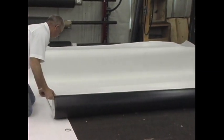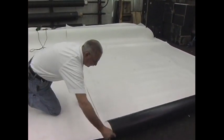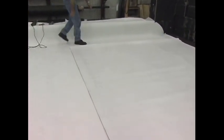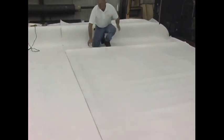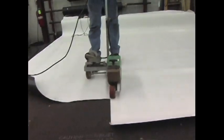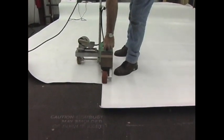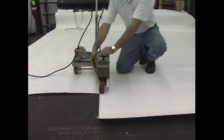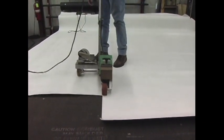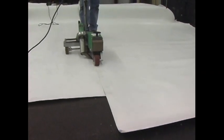Step 3. In the field of the roof, position the VersiWeld membrane over the substrate whether using 8, 10, or 12 foot rolls. When encountering penetrations, cut the membrane to fit as tight as possible around the units. Utilizing the pre-printed X markings along one edge of the sheet, install all of the required fasteners. The HPVX fasteners and plates are required for membrane securement. End lap splices are set at a minimum of 2 inches to achieve a minimum 1-1/2 inch weld; no mechanical securement is required at this location. The sheets are typically fastened a maximum of 12 inches on center. After the sheet has been fastened in place, position the next roll of membrane overlapping the adjoining sheet at least 5-1/2 inches.